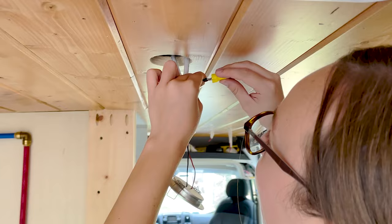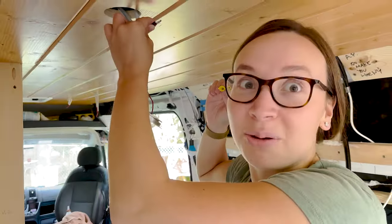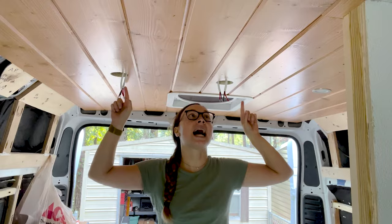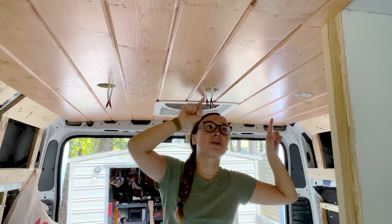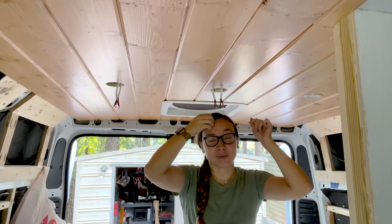Electricity always takes the path of least resistance. So if you give it multiple paths, it'll take the one that it can flow from. That way, if one of those blows, instead of it blowing the entire series of lights, because it's in parallel, you will be able to identify which light is messed up. If you have them in parallel, the electricity has the ability to go through all of the lights while skipping the one that doesn't work, because you still have the wire-to-wire connection.